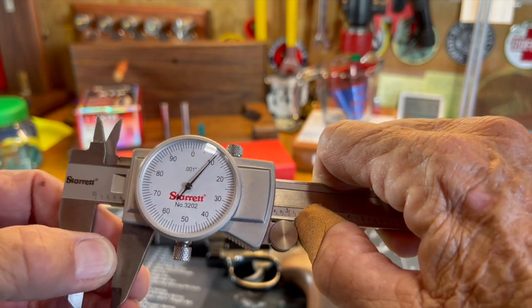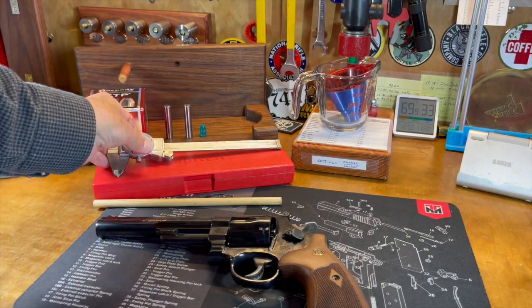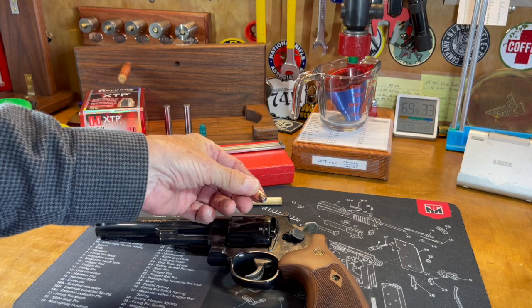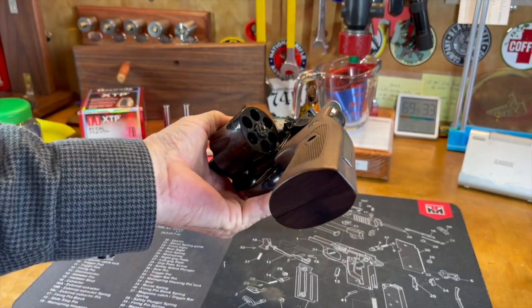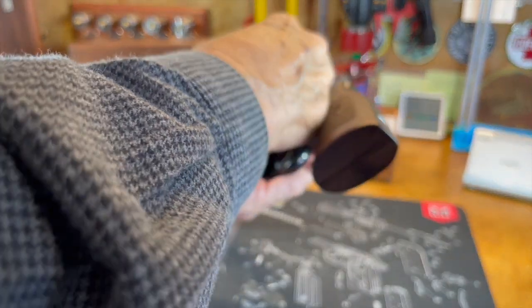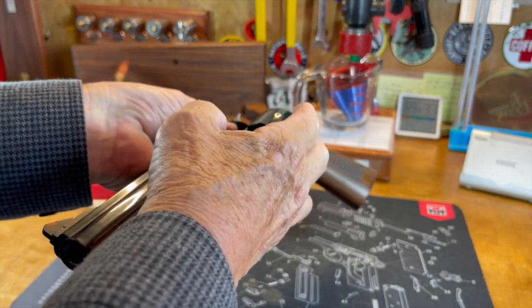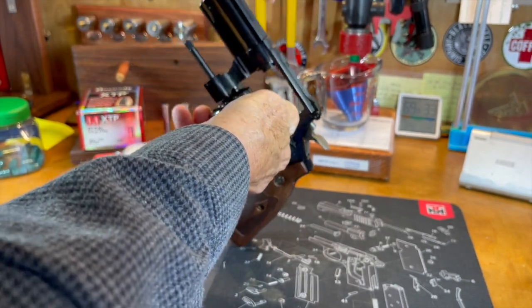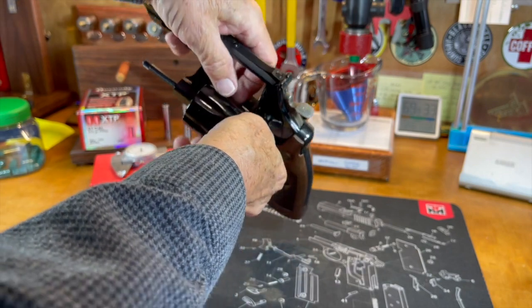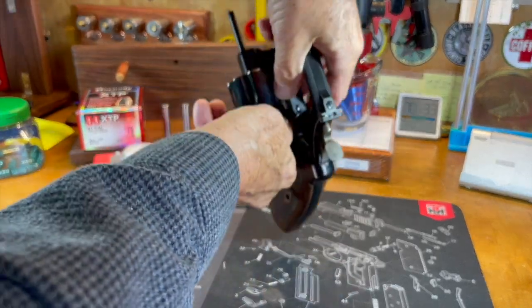Rotate it — nothing happening on that needle. So what I meant by 'hope we get lucky' — let's see if this bullet at 0.410 will just drop through the cylinder. And it does not go all the way through on that one. You can see this firearm is clear. That bullet did not go all the way through. Let's try a couple of other cylinders just for grins. It didn't go through that one either.